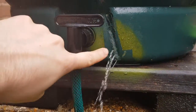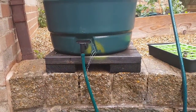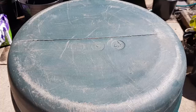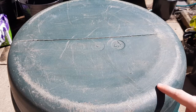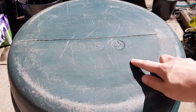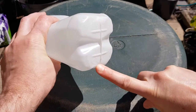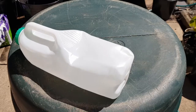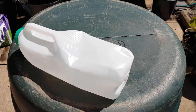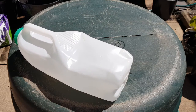I've tried to fix it before but I should give it a go again. I waited for the rain to stop — the sun's come out and it's dried off. I've emptied the tank, got it out of its position, and flipped it upside down. It's an HDPE tank, and I've got some spare HDPE from an old milk container. I'm hoping I'll be able to make a patch to cover that split and plastic weld it in place.